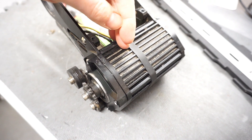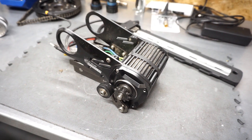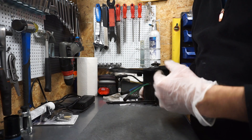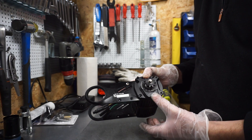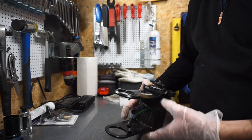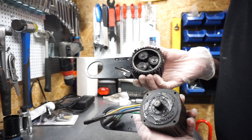Once I get information from CYC I need to pull this part out of the motor. I've removed the controller to avoid anything obstructing access to the gears. I already removed all four bolts and the tensioner, and I can see I don't have to remove the sprocket because the whole gearbox assembly comes out very easily.